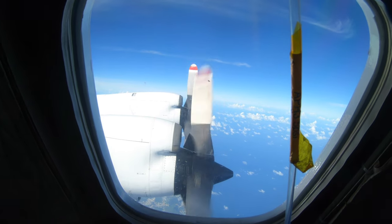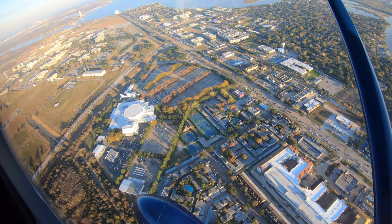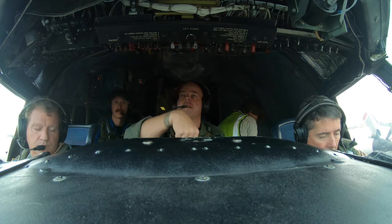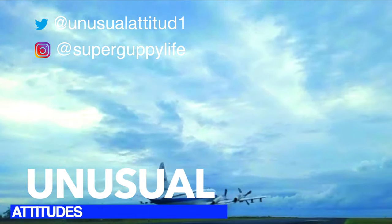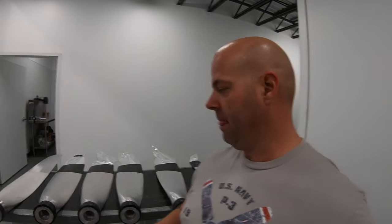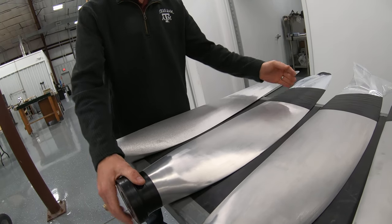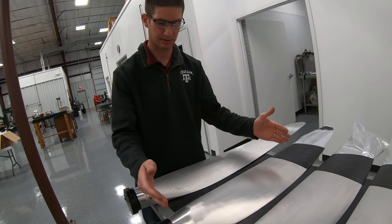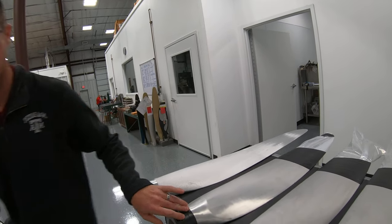Let's get started. Once you're done cleaning everything up, if it's a blade that needs shot peening, it goes to shot peening. Here's what the blades look like before they're peened. They're masked because the manual requires that only a specific station, like the 8 to 30 inch station, be peened in this process. So you can see that we've got it masked here, and then it goes into our shot peening cabinet.